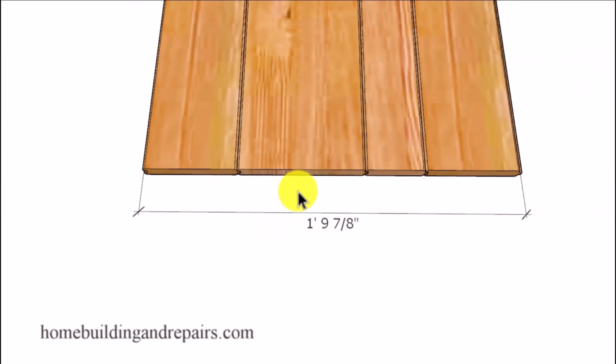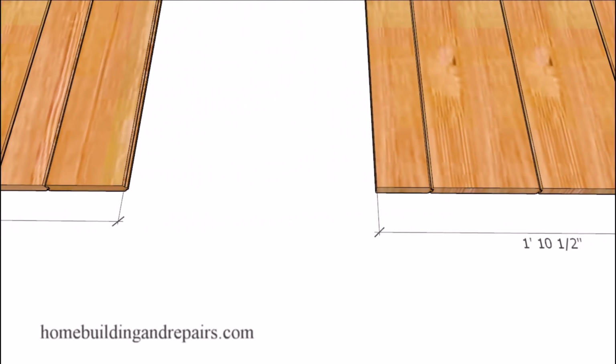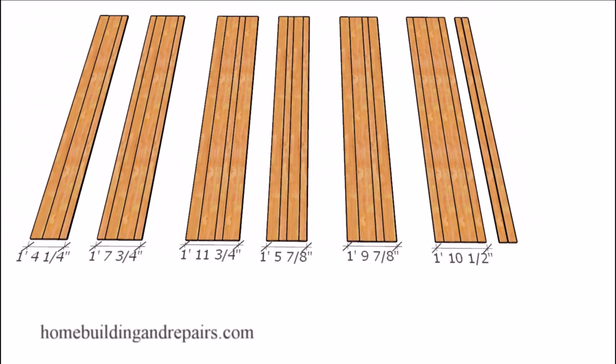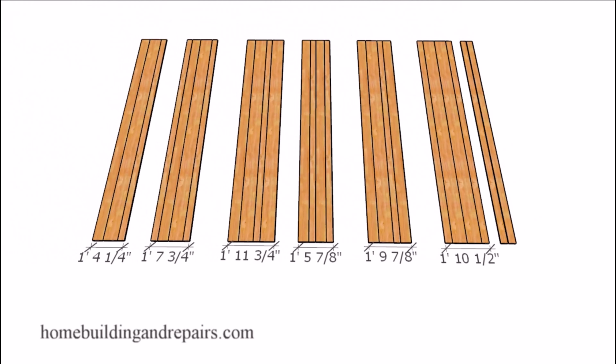And these are things I rarely come across. Even this one here, I rarely come across something as simple as this, where you can simply rip one of the boards in half and place one at one end and the other at the other end to create square sides that are going to be easier to nail, provide us with a little more structural strength, and it might not split as easy when we're nailing the sheathing to our blocks.